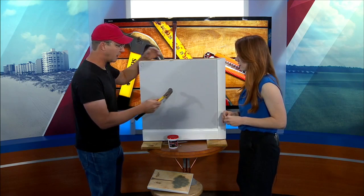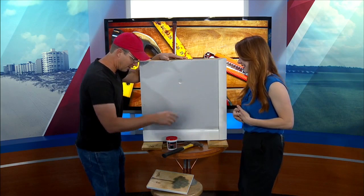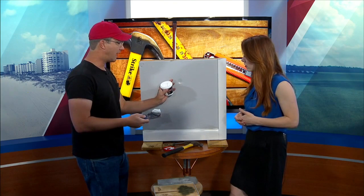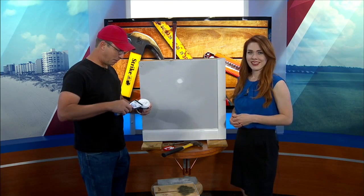Watch this. See that? There's a little dent. It's scary, but it's going to be fine. Now you take your spackle and a three-inch putty knife — kind of flexible, a little metal one. Lightweight spackling is what I recommend. It's really smooth and goes nice and easy into that little divot. You put that in there and wipe off the excess. Look at that — no gigantic bump, no big smeary nasty thing right here.